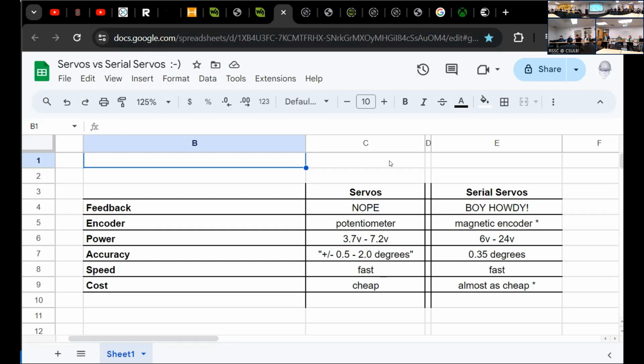And that's why when we talk about servos, we talk about open loop control. The servo internally operates closed loop. You give it a command and it meets it. But as you send it commands, you have no idea what the status of the device is. And that gets really frustrating. From the nerve-wracking moment when you power up your little device and you send it its first motion command, hopefully it's not going to swing its arms around or flip over or anything.